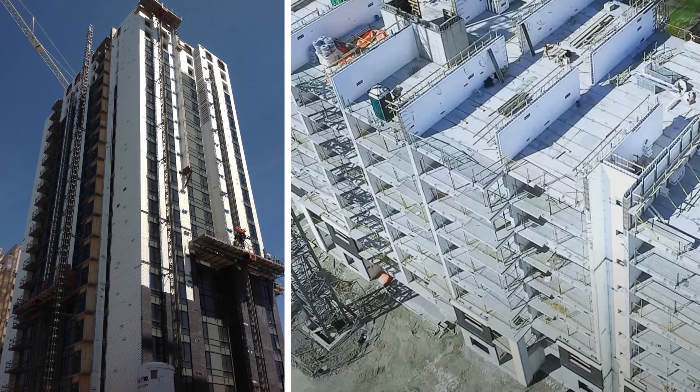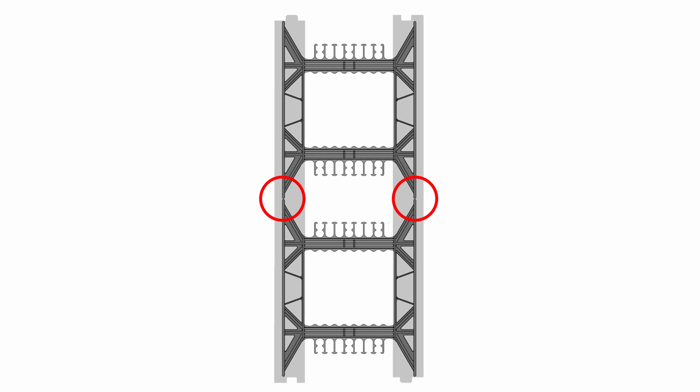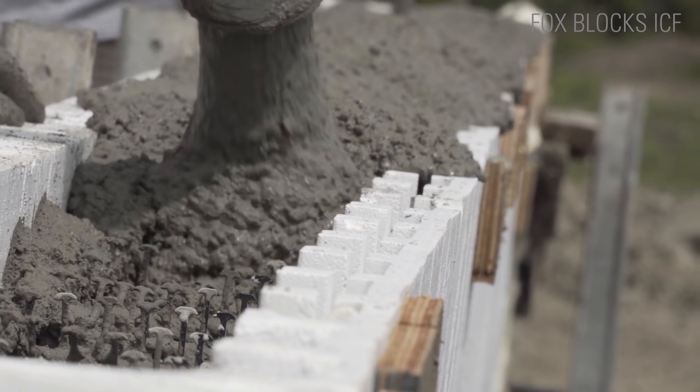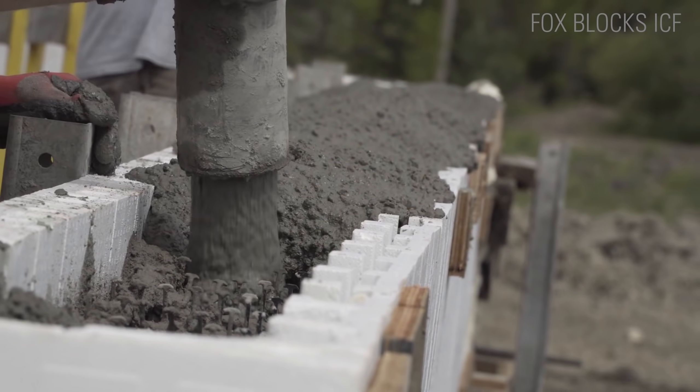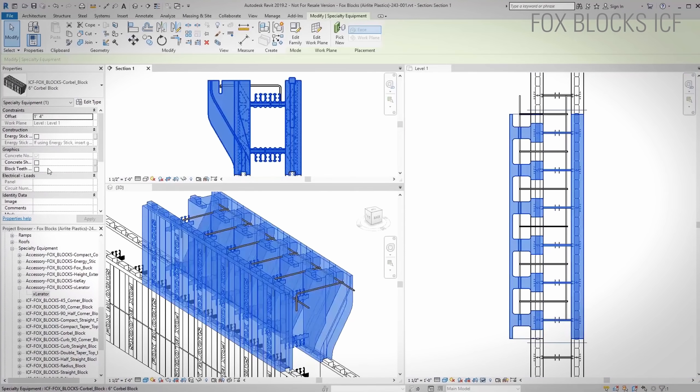ICF wall construction is very versatile. I thought it would have some height restraints, but you can build multi-storey residential buildings with these blocks. They can also be used on slab-on-grade or pier and beam homes to build walls from the basement up to the roof. You can use all sorts of exterior finishes on these blocks. One big advantage of Fox Blocks is that they use full-height ties so that when you stack the blocks, the ties are sitting on top of each other — not just foam sitting on foam — so your wall won't compress once concrete is poured and will maintain the correct height. For those interested in 3D modeling, Fox Blocks has an extensive BIM library where you can assemble your complete home and generate cut sheets and specs.